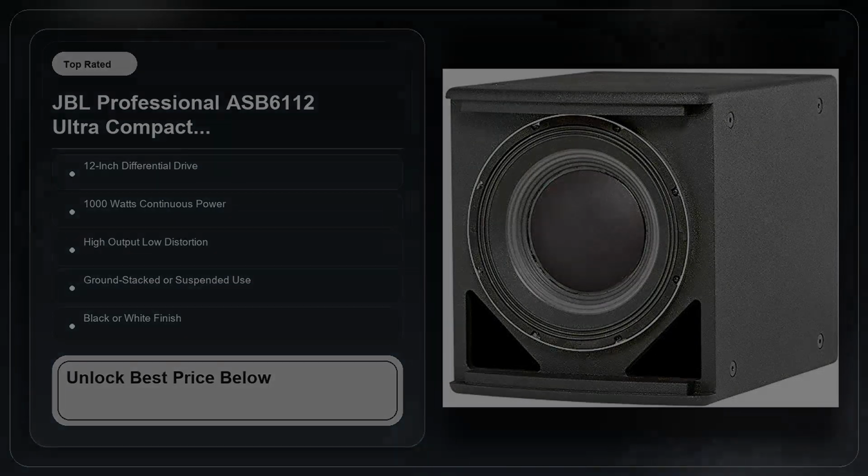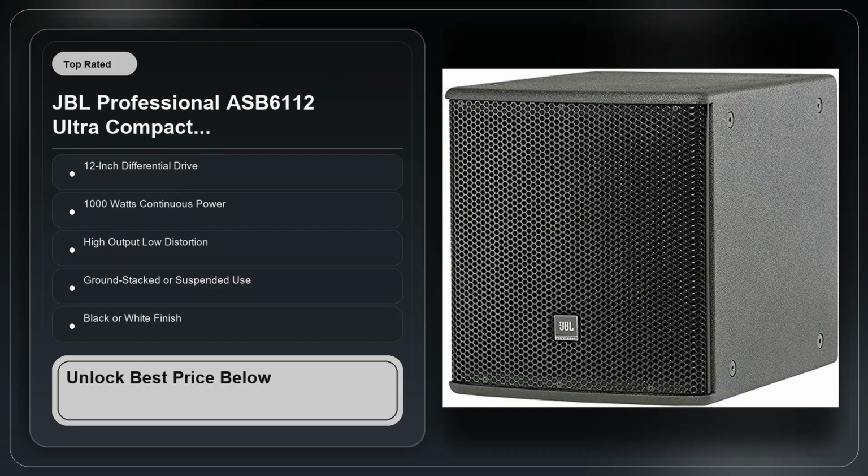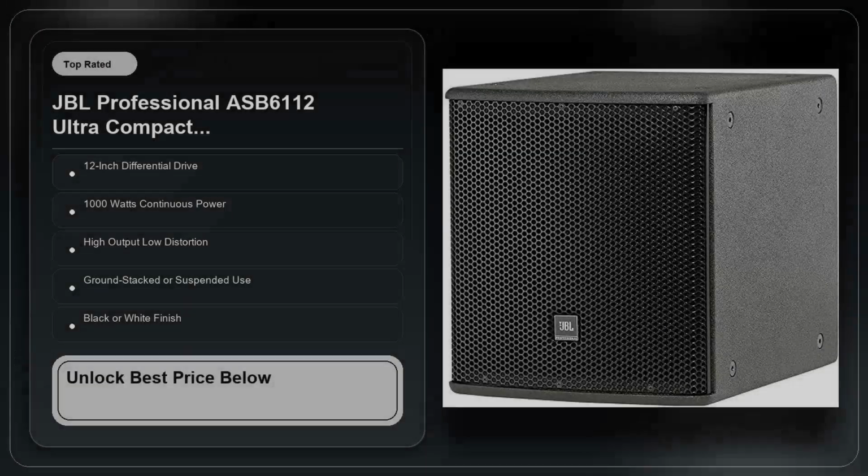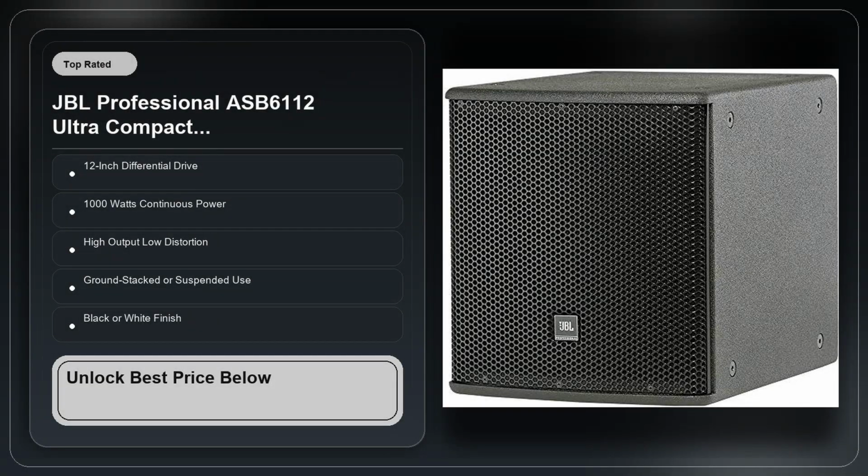If you already have a 2-channel power amp, you can drive the 2 voice coils independently and fine-tune the low-frequency response without buying an extra amplifier. That flexibility can shave a few $100s off a system that would otherwise need a dedicated subamp.